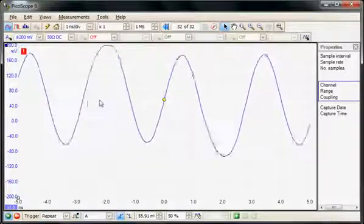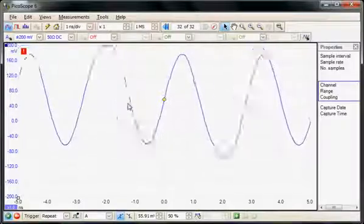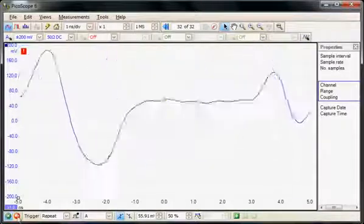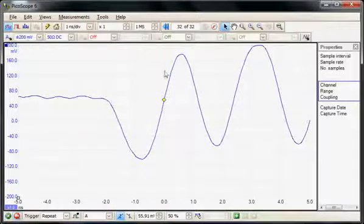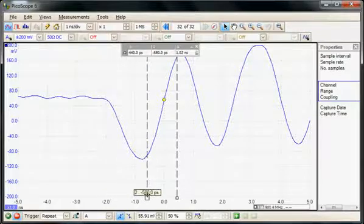So the first thing I'm going to do is capture this very fast telecom signal and make a 10 to 90% rise time measurement. So I'll just stop the acquisition on this signal, and here now we've got a rising edge, so I'm just going to use the cursors to make a measurement just to check the specification of the instrument. So I'm just measuring a 10 to 90% point, and here we see in fact it is measuring the 1 nanosecond. So from this we can see that the instrument does reach its full 1 nanosecond specification.